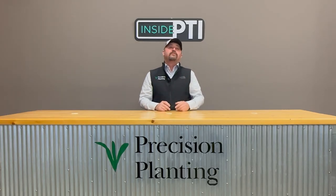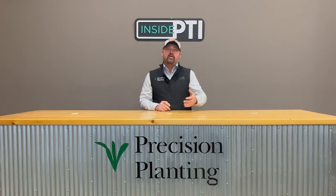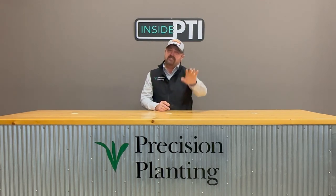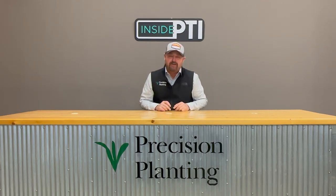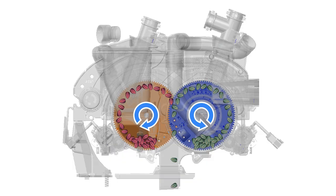We've got technology on the planter. In 2014 we came out with VSET Select — single row dual meter technology. We've got two meters on every single row; we turn one on and one off to plant the right corn hybrid. We're locked and loaded with two hybrids in our CCS tanks — I like to think of one as a more offensive hybrid and one as a more defensive hybrid — and then we change that hybrid selection as we travel through soil variability in the field. We also have the ability to do variable rate seeding at the same time, which in combination I think these two are pretty powerful in addressing soil variability.